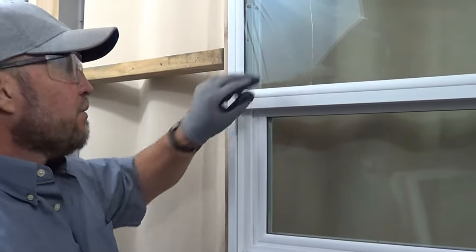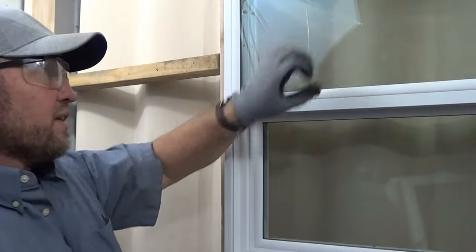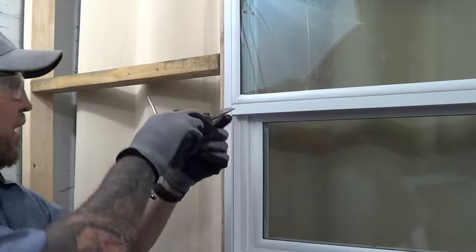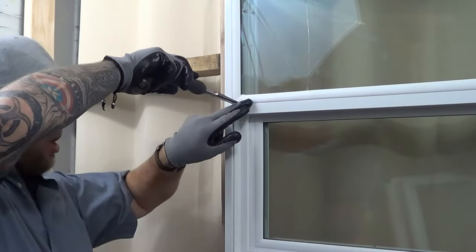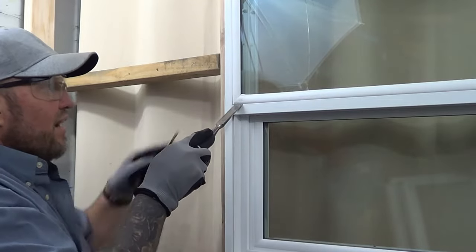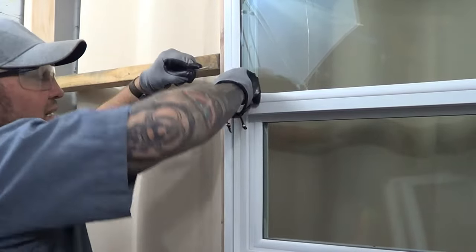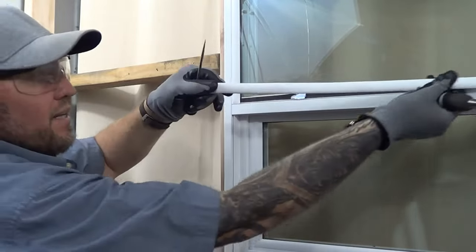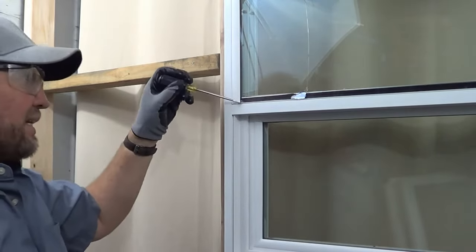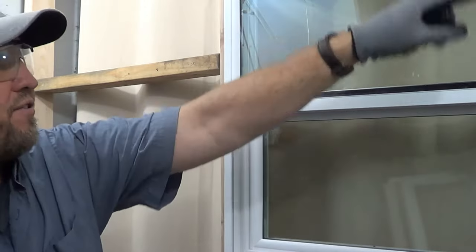We're outside looking at the window from the outside, and we're going to talk about getting this glazing piece off. First, just make sure you have your safety glasses and some gloves on. We're going to be working with some real sharp edges, and who knows what's going to fall out when we start working on that. What we're going to do is get our one-inch chisel and push it right in this corner here — push in deep right below the glazing, between the glazing and the frame. We're going to push that in and give it a little turn, and you can see how that pops out. Sometimes I like to give that a little help with my screwdriver. Once you get this piece out, it kind of just pulls and this whole piece gets out. This is the hard part, really. We're going to do this all the way around. If it's old and brittle, it might chip and stay in the groove — we're going to need to get that out because a fresh piece needs to get in there. Be real careful on these shards. We're going to get all four of those off and move on.